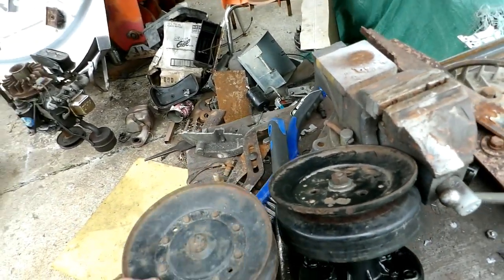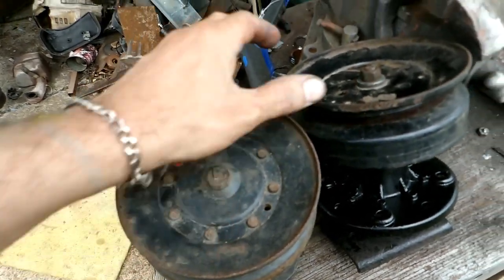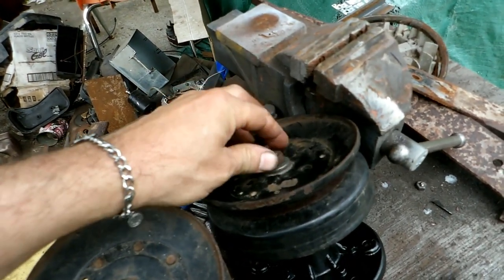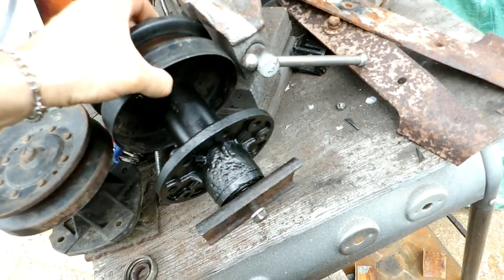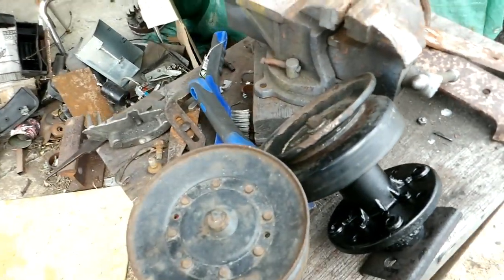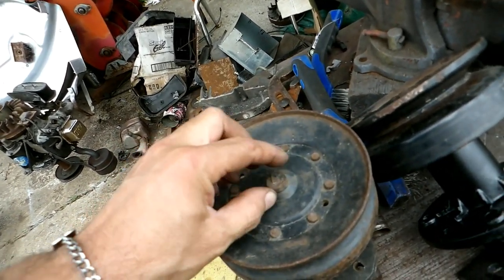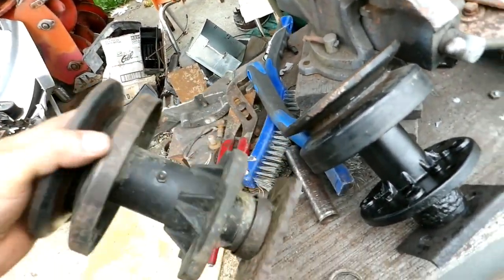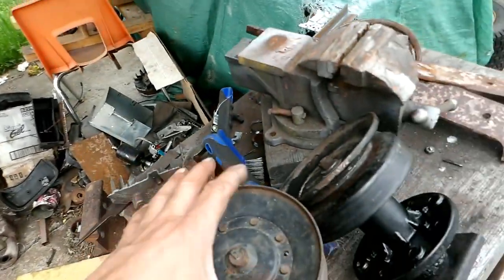I discovered something about these - there's two types. This one's welded in and the other type is bolted in. This one here is the one that blew the bearings. I put new bearings in it because you can unscrew the nut, take the pulley off, drive the shaft out the bottom - in this case it fell out - and then just put new ball bearings in the top and bottom. They're just standard bearings. With the welded type, you'd have to grind the welds off, cut the shaft off, get that pulley off somehow, and then put new bearings on.